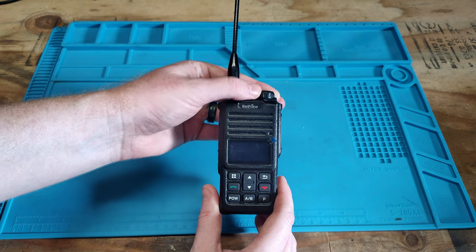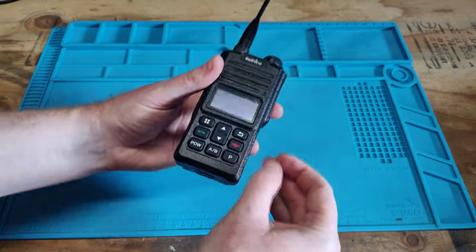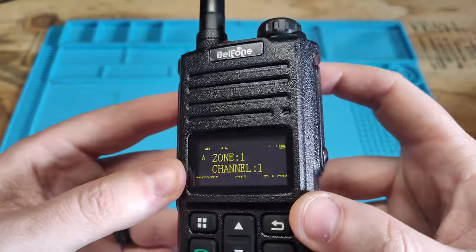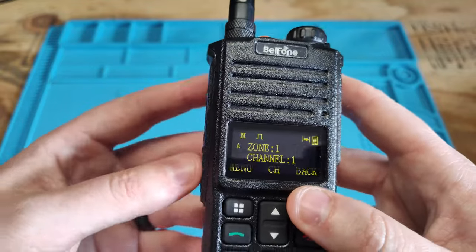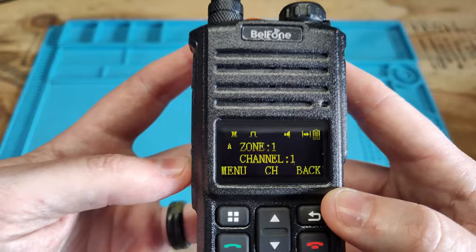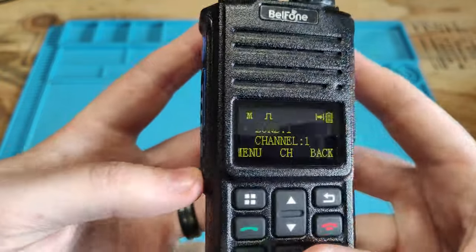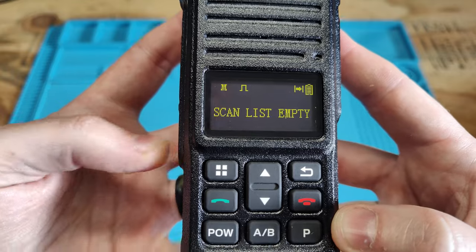So let's go ahead and turn this radio on. I'm going to take off the screen cover. Let's take a look at how this came programmed out of the box. You may see some flashing on the screen — it is not doing that in real life; it is just a frame rate issue with this type of screen on a camera. Both of our transmit buttons will just transmit. The top button on a short press is set to turn monitor on and off. Long press changes the transmit power and cycles through high, medium, and low. The bottom button short press is VOX enable/disable, and long press is scanning.